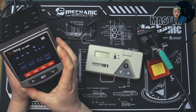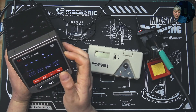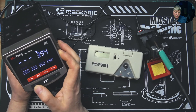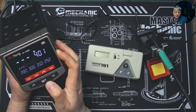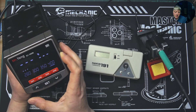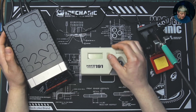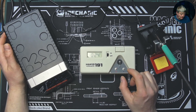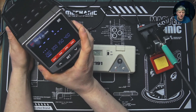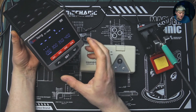You just select there and it will put you the right temperature. So if you want to put it back to 400, just go to 400 and hold it, and it will put channel 4 back to the temperature you selected. Now let's turn on the thermometer for measuring the tip from the soldering station, and we're gonna start with the preset of 280 degrees. You can see it's set up on that one.